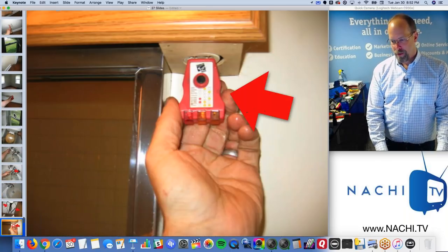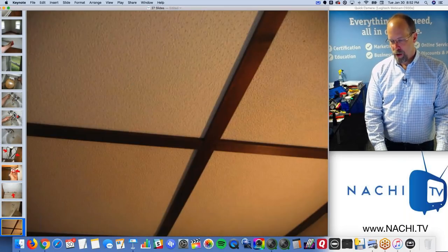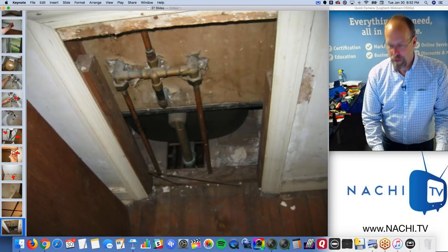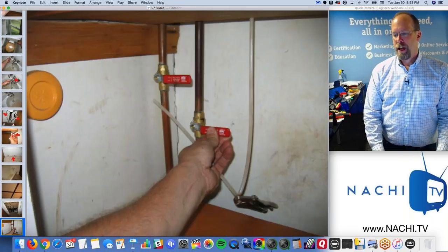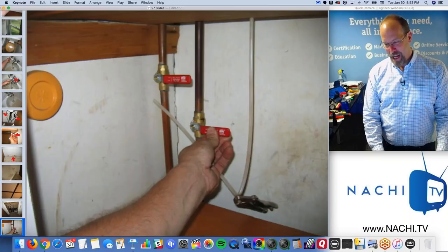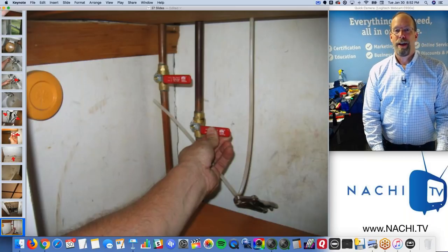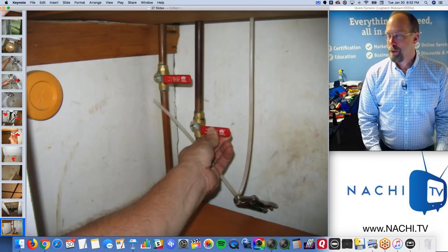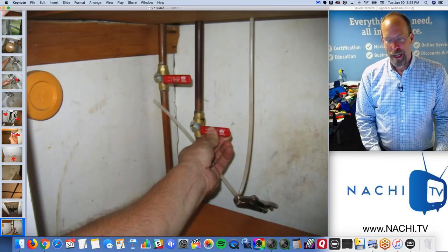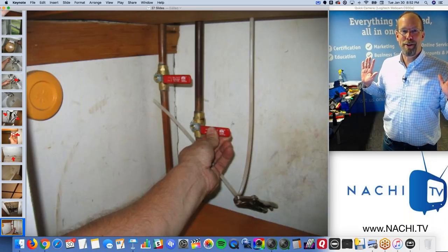The shower doesn't turn on well. Missing ground fault, broken tile. Tub works, shower doesn't. Open up the tub panel, access panel. The water is turned off. So in that closet of the first floor bathroom are the shutoff valves for the second floor. Home inspectors are not required to turn on valves. If they want running water upstairs, someone else has to turn on those valves.